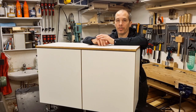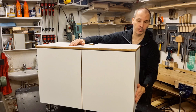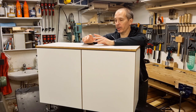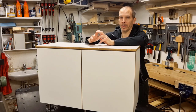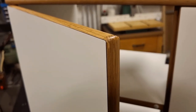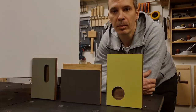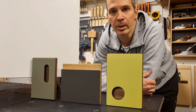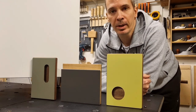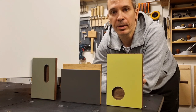This bathroom cabinet is a typical example where laminate can be used to its advantage — the top surface, sides, and door fronts will be exposed to water, toothpaste, hair products and more almost daily. The laminate is a really durable material that is easy to clean. Combining the laminate with edge trims in solid oak gives the cabinet a slightly more custom woodworking look rather than an off-the-shelf product. We've reached the end of part 2. In part 3 I'll focus on integrated wooden features combined with these materials — typically drawer or cabinet door handles — and I'll build three samples. Thanks for watching.